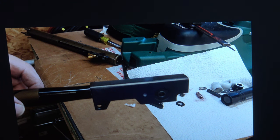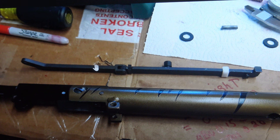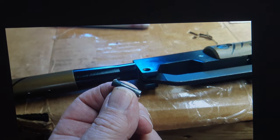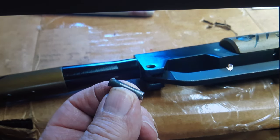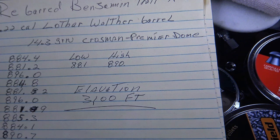Here's our two-piece cocking arm. The nice thing about a two-piece cocking arm is it lets you take the barrel off without pulling all the guts out of the receiver. We installed the cocking arm pin — once you push these out you lose the flare and they can get buggered up. This hole was tight, so I just put in a new pin, flared it, and we're done. That old one can be saved for another gun.